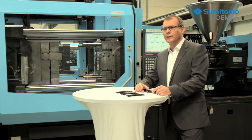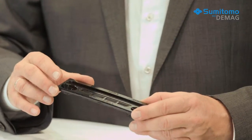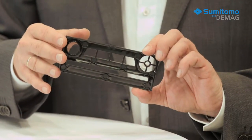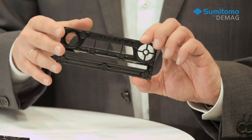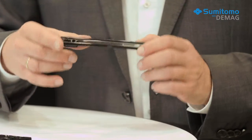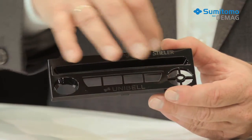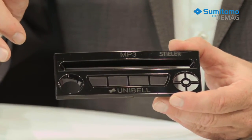The external gas pressure technique means injecting high-pressure nitrogen between the cavity wall and the moulded part. The gas applies an even pressure to the back of the part, so you get a very good reproduction of surface detail on the front. If we look at the finished part closely, we see that sink marks only occur on the hidden side of the part. We get immaculate reproduction of surface detail, even in thick-walled parts that are further away from the gate.